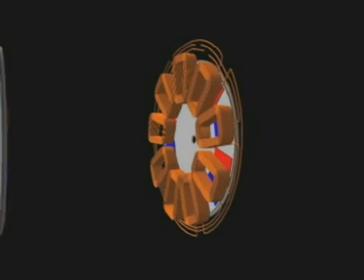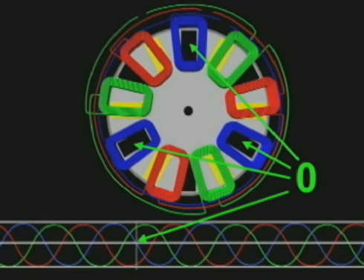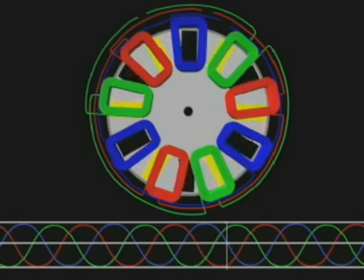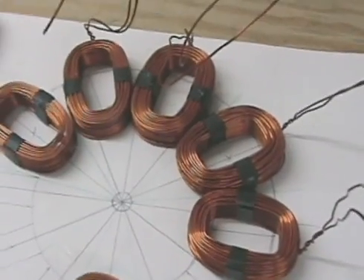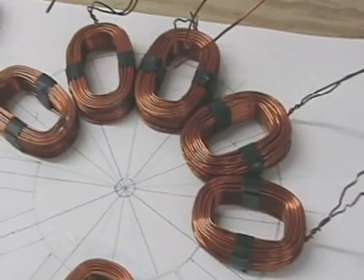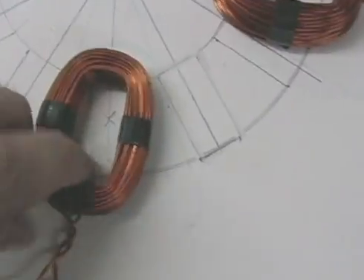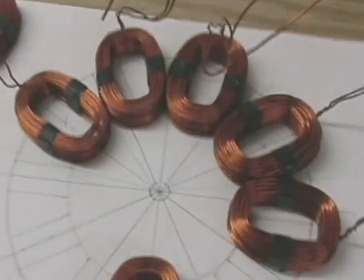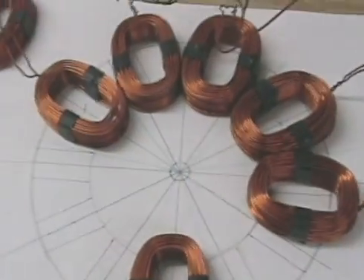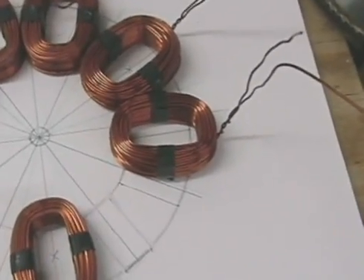With 12 magnets as they pass, they line up to the zero point — the crossover point where the magnet is in the center, going from one field to the other. You've got three sine waves. This will all get cast in resin. I could do it without casting since I have no intention of running this on a pole outside in the weather, but the resin adds stability. I'll probably use some wood pieces around it as filler to give me anchor points, so I don't need to fill the whole thing with $60 worth of resin.